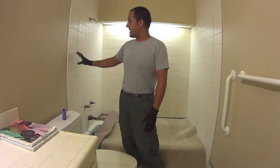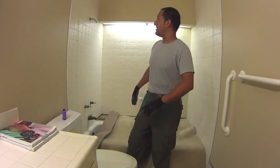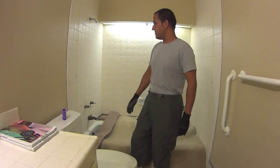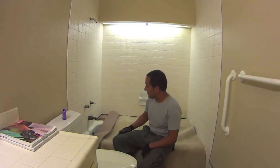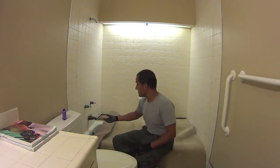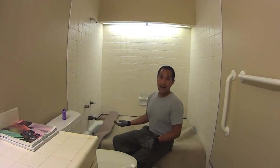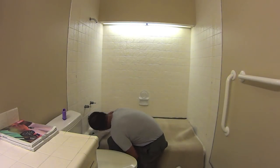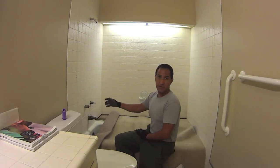I've seen YouTube videos on how to remove tile, how to remove the spout and other pieces of the bathroom area. Up until now, everything has gone without a hitch. It's just like I've seen on YouTube. But I'm about to remove this spout here, and I'm told on YouTube either there's a set screw underneath that I just need to unscrew and pull it off, or conversely, you just need to turn the spout and it'll unscrew off. I don't know. I'm looking at it. Frankly, I don't see any set screws under here. I don't feel any. So I guess it's going to be the turn type.